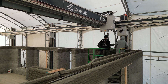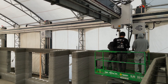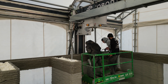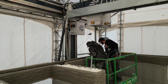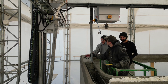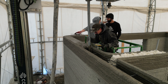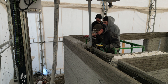Even when the printing is done there's still concrete left to be poured. In this case they have a bond beam going along the entire perimeter of the top of the building — around the top foot or so. The walls on the inside have received spray foam insulation, and the printer itself is being used to deposit regular concrete — a different mix than printable concrete — into this bond beam, which already has a rebar cage installed throughout. Especially in windy regions like Siksika Nation and Calgary, it's critical to have a really strong bond from your roof truss system to the building itself.